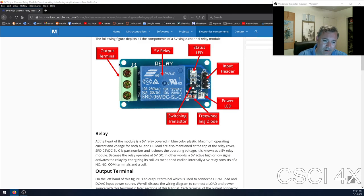So what you have over here is three connections, and these can be beefy lines too, because remember, these things can hold 10 amps. Like a desk lamp, like I said, you could get those big, thick copper wires and feed them into these. But we're not going to. For this class, just take the normal dinky little wires we have, like I showed you guys last time with that camel. Put one in here, one in here.